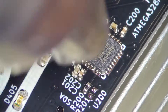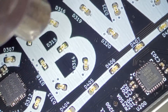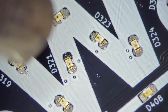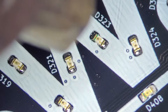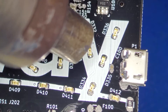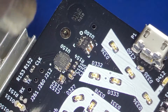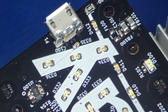What I'm really looking for is the molten solder's surface tension to bring the part into alignment. Then I can have high confidence that not only is the part aligned well, but the ground pad underneath is melted too. The LEDs are much simpler to solder as they only have two terminals. If a part doesn't go into alignment, I'll quickly try to nudge it back into place while the solder is still molten. If I'm lucky I can get it into place, otherwise I'll let it cool down and come back to it if I've been heating it for too long.